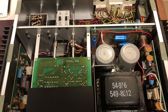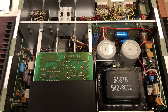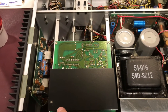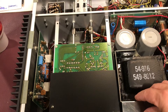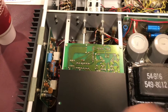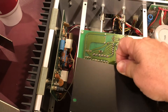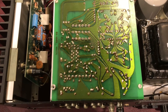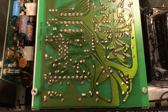To replace the capacitors on the preamp board, I've taken off the bottom cover and the top cover. We're going to need to remove these plates. There's one screw here, and two screws on the bottom side, and that will allow you to remove those plates so you have access to the board and you'll be able to do any soldering to remove the capacitors and install the new ones.